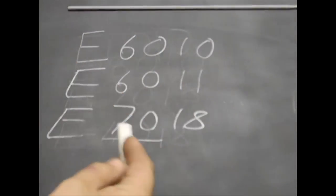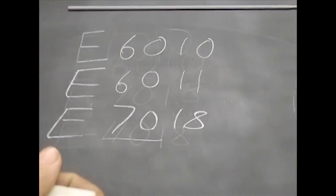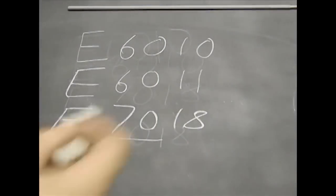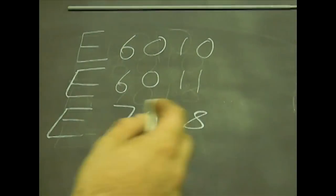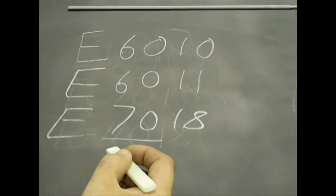You don't have to use just one rod on a project — you can actually use several different types of rod. Let's say you're doing pipe welding, for example. Some people will use a 60 series rod because it's more aggressive and it gets more penetration into your root pass. They'll chip out all the slag and then do a 70-18 cover to add the additional tensile strength to the weld.